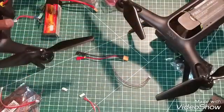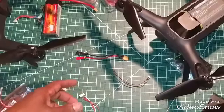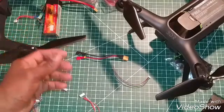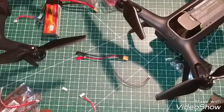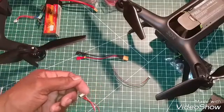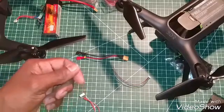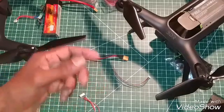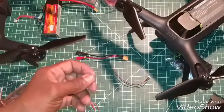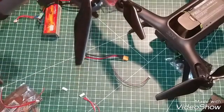One thing you have to be aware of is that the BMS can only register at most 17 volts — usually it's about 16.8 volts on a normal charge. On 17 volts, the percentage of the battery is not going to show the same reading. When you're looking at your transmitter and looking at the percentage, it will not show you exactly what battery charge is left. I always pay attention to the battery voltage. I'll fly it till it gets about eight percent, which in reality means the battery voltage is actually much higher and I can get more flight time. I've been flying it down to about 14.0 to 14.10 volts and it's been fine — because the BMS was only designed for 16.8 volts.